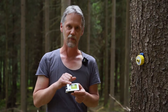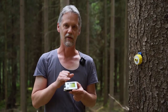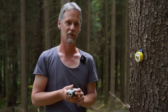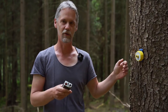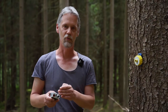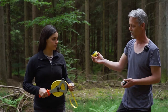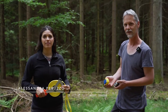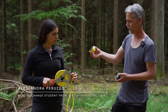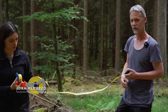In the settings menu we find a menu for calibration, and in addition we need a tape because we need to measure exactly 10 meters between the backside of the transponder and the front side of the instrument. For this next step I have help from my student Alessandra from Italy, and she will take the tape and also the transponder.